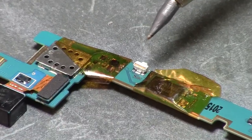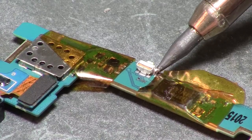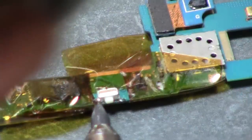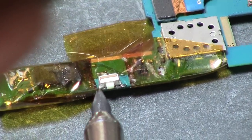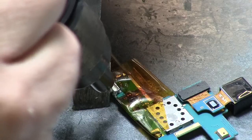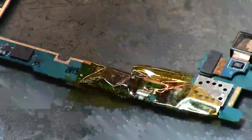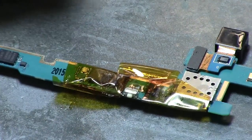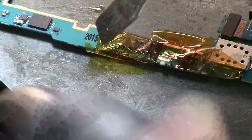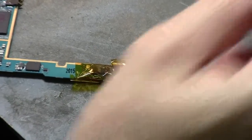Put some solder around the connections where it holds it to the motherboard — that's where you want to start. You're going to try to block the heat from the power button because it's plastic, it's going to heat up and melt. You're going to see it change a little bit of color — that's fine — but try as much as possible not to put any heat towards the power button. Put it at an angle so the air slides away from the power button. You can also help it with a little bit of flux — it makes it bond faster.